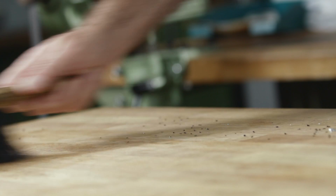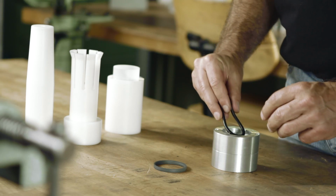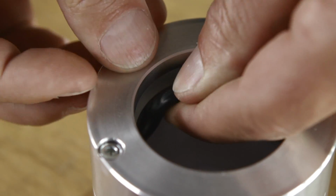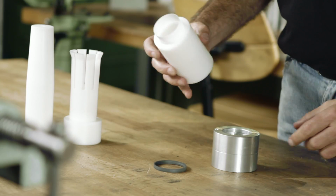The installation of rod seals on a clean support plate is recommended. Install the pre-tensioning element into the groove. Avoid twisting the O-ring. Place the installation cone into the bore so that the edge of the tool ends exactly at the groove flank and all grooves above it are covered.